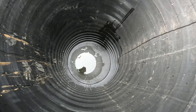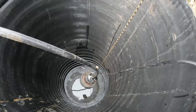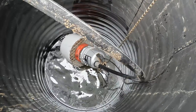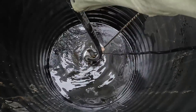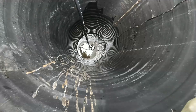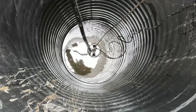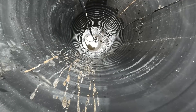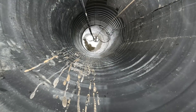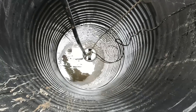150 to 155 gallons - everything still looks good there. I'm going to put that pump down in there now and we're going to start running the line up to the cabin. There she goes - only took like four or five minutes to pump that well out. And of course now there'll be six inches of water left in the bottom, which is fine. That way hopefully my pump will never suck up any sand. So now we're going to continue on with our piping system right up to the cabin.